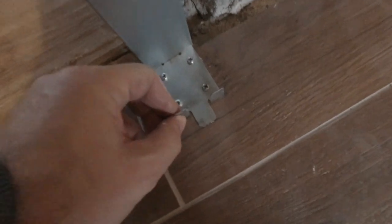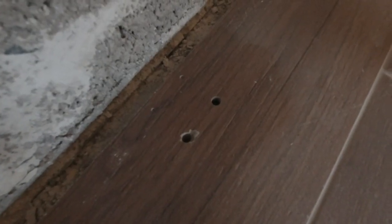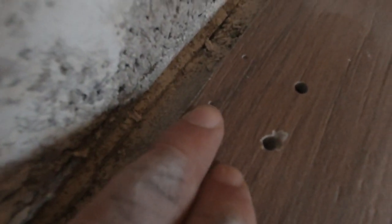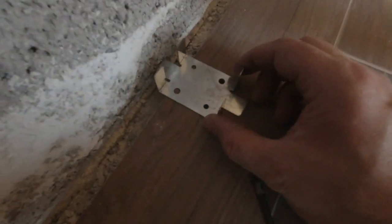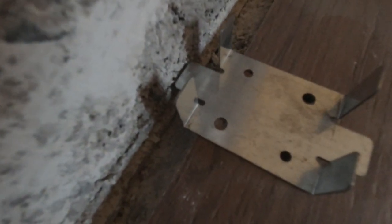Now this is the bit that I was easily scared of the most: fitting these brackets onto tile, and then drilling these holes into tile. It takes specialist bits and a hell of a long time. Really have to be patient with this kind of work. Also, these holes are quite close to the edge — there's not a lot of play there — and I'm a bit afraid I'm going to break off the edge of this tile. The other thing is that bracket is going to sit here, and the upright is going to go there, sitting just over empty air. Which means I need to backfill this gap with a bit of concrete as well.